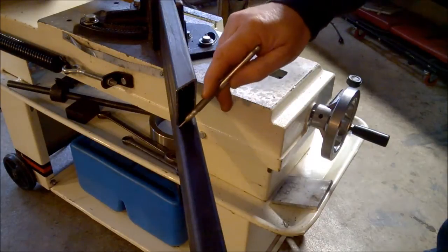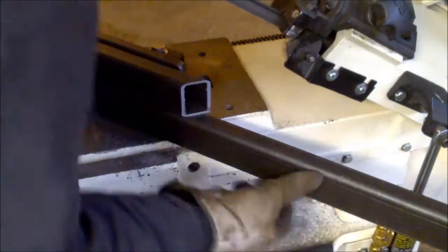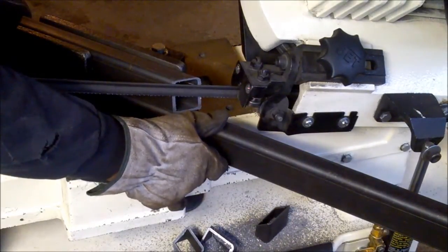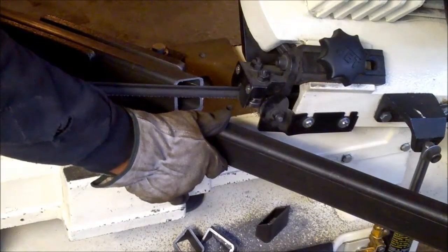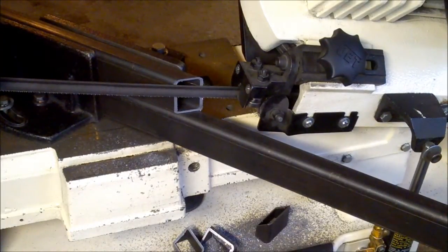Here's another option for doing multiple cuts of the same size: line up the ends as before, set your previously cut part on top of the stock that needs to be cut, bring the saw blade down and run your material until it just touches the blade — that lines you up for the next cut. Tighten the jaws down, check they didn't move, and start the saw. The beauty of a bandsaw is you can let it do its work while you move on to other tasks — it's a low-buck CNC, just kidding.